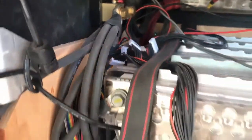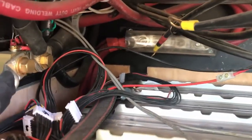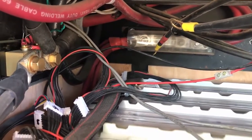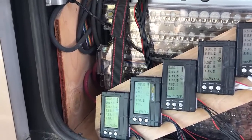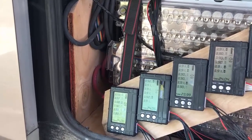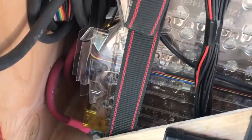That means you can remove one battery easily. The same is the case for the positive side, where five wires go into a four-gauge lug. You have to be a little careful when you disconnect this, but we've put plywood all the way around in the box so there's no metal that can be contacted directly with the lugs. When we take a battery out, we put some tape around the positive — that's enough to insulate it.